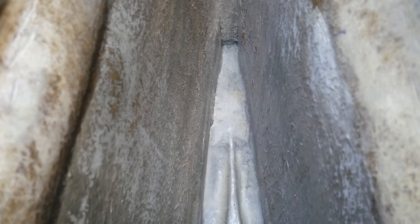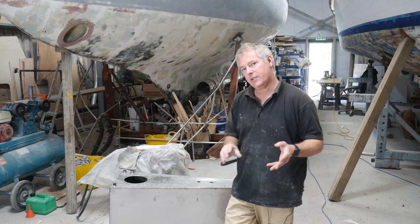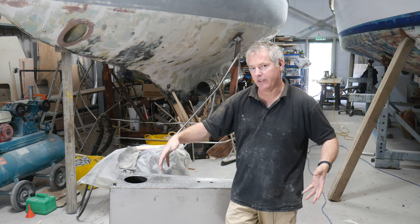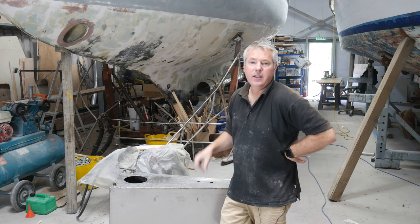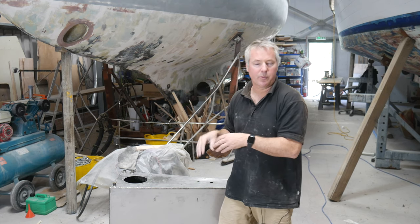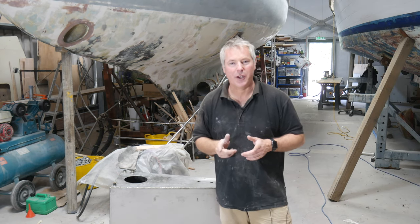There is a little bit of moisture showing on my moisture meter right down the bottom there. I'd really like to get all this flow coat off so I can put a brand new flow coat on to really seal it up - and also just to see what's behind it and make sure everything's okay. Now the first thing I want to do with this tank exercise is create a template or replica of the tank out of plywood. If I go with stainless steel I need to drop the tank off at the fabrication yard and they'll need it for four or five weeks - so in the meantime I want my own templated model to look at how it'll sit back in the bilge. Either way, it's good to have a lightweight accurate replication so I've got something to play with. Now's the time for some fun woodwork.